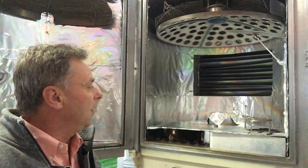The material gets placed down on this plate over here and also in this other area over here, where you can see the flow of electrons come down and bombard the material that vaporizes and goes into a cloud inside that chamber.